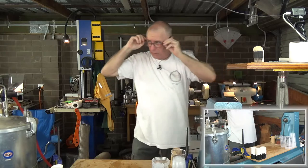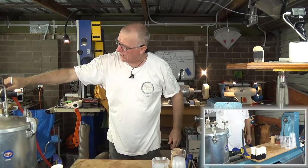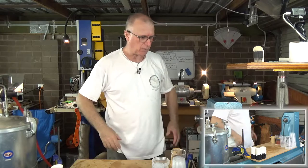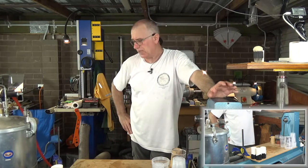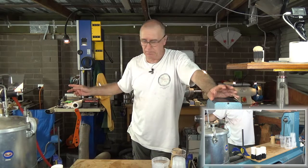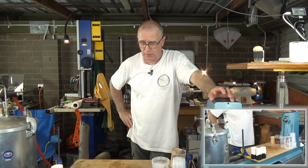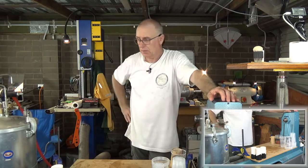Looking at that one when I had the pressure pot open, I'm not holding much hope that we're going to be good with that timber one. I think we're going to end up with holes and bubbles in it. But we'll see anyway. We'll soon know once we start. And if that's the case, I won't be doing the other five. I'll have to get a vertical mould set up for them so that I can do them vertically, and that way it should allow the resin to fill up.